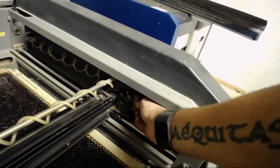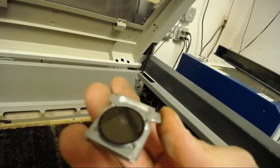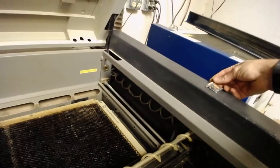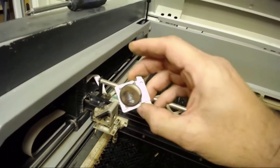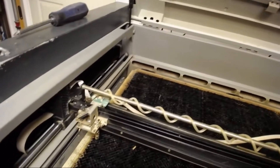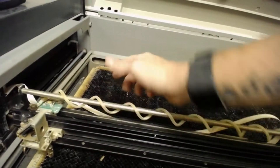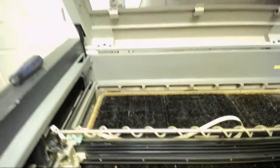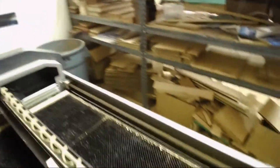There's another mirror right here with a simple screw on the back — you loosen it and the mirrors on the EX Series just pop right out. You can see just in the center where the laser's been hitting, there's started to get some accumulation of dust. We'll set that off to the side. Now inside here, the piece that I'm touching right here — that is your encoder strip. Now if it gets really dirty, we can take it out and fully clean it, and since this video is about fully cleaning, we're going to.